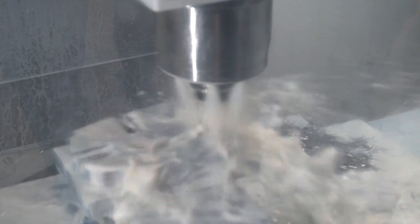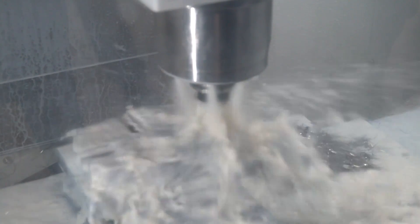Give me one of the highlights of this machining demonstration — the interpolation maybe? Well, we have a few here we can talk about. We've got the circular interpolation: with the 12mm tool, we're running 12mm deep, at 1.75mm step-over, and we are running at 6000 feed rate and 6600rpm.